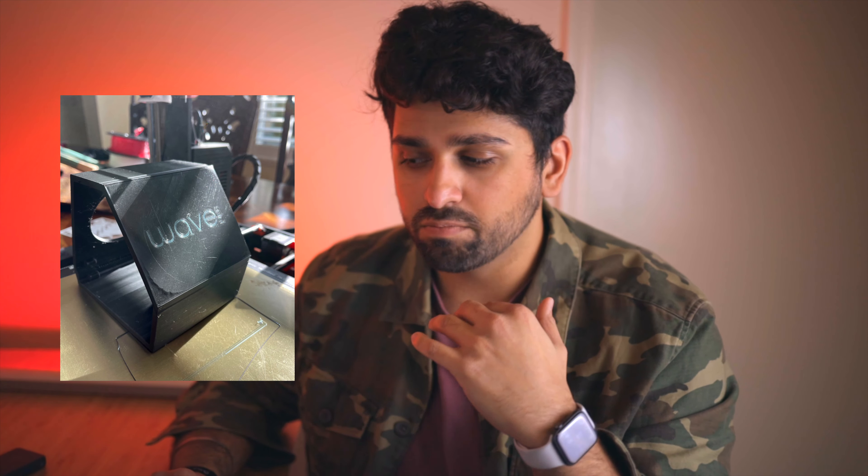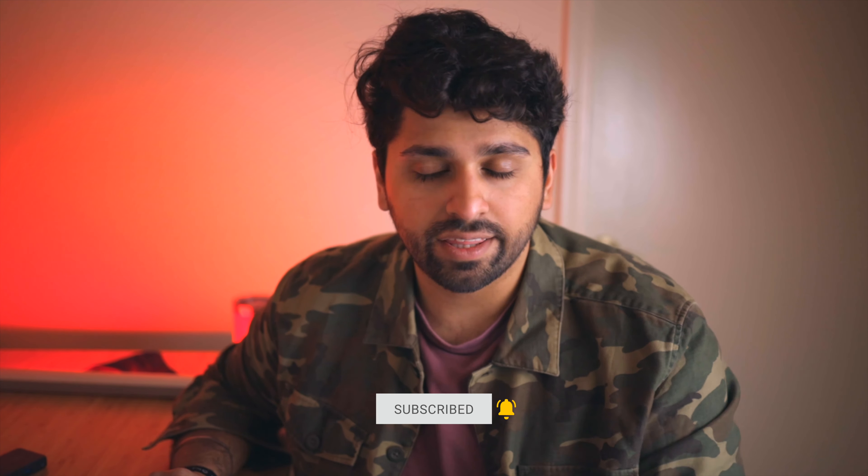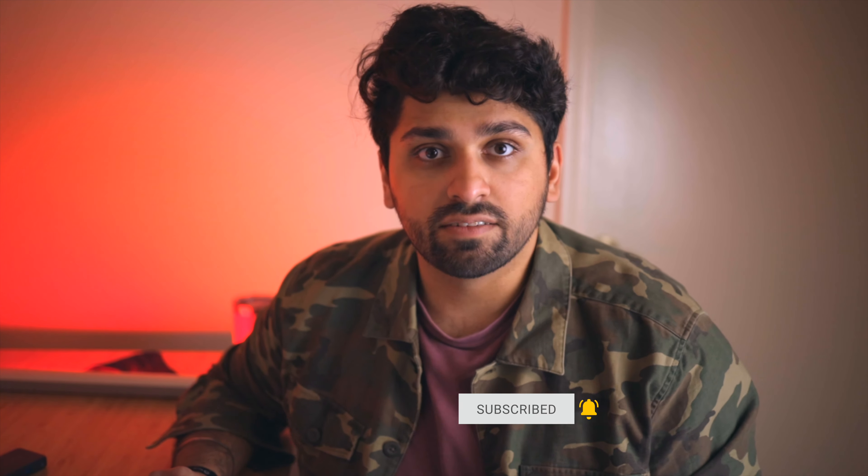I tried a technique to have the second layer embedded in the original layer using Prusa Slicer, so I had it print the blue and then in the same build plate it would print the black for the rest of the enclosure. I'll be doing a video on how I got this multiple extrusion on one build plate to work with just a single extruder — I didn't use the multi-material upgrade or the Palette 2 or anything like that. Be sure to subscribe so you can see that video when it comes out.